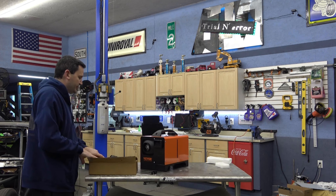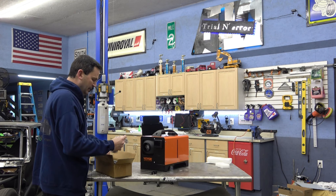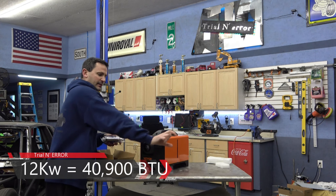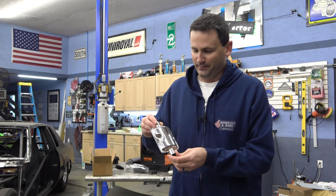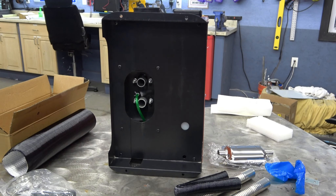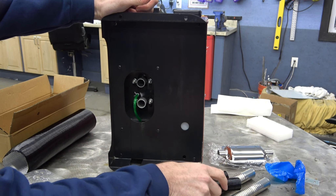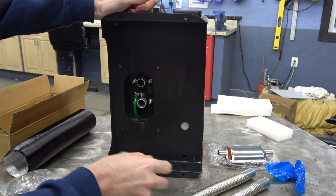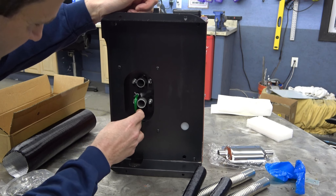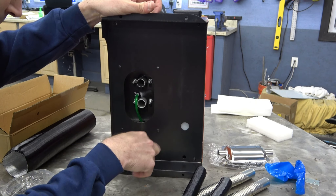This is their larger option — eight kilowatts. BTUs and kilowatts are just different measures of heat output. They pulled this little muffler right out of the Honda Civic parts bin — adorable. On the bottom you can see the burn chamber. I'm assuming that's fuel in, and close to it is probably the fresh air intake for the burner, so you can pull air right from the room — no need to duct that one out. Then this must be the exhaust, since it's separate from the fuel.